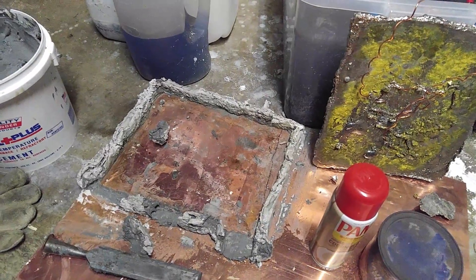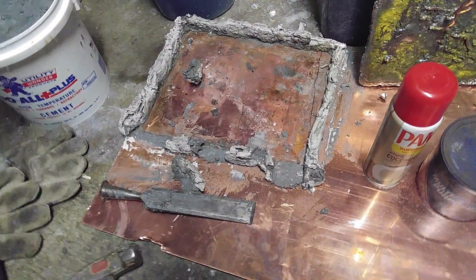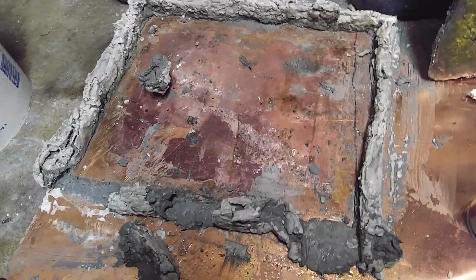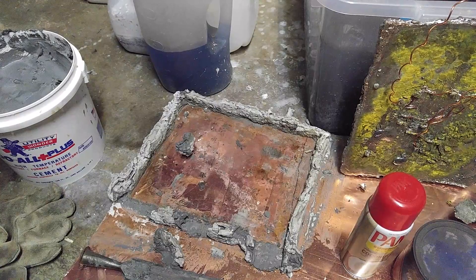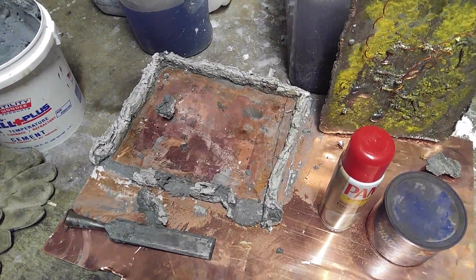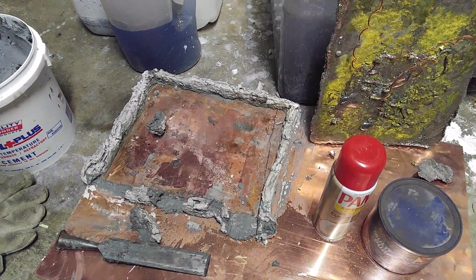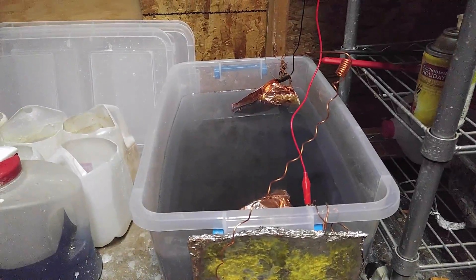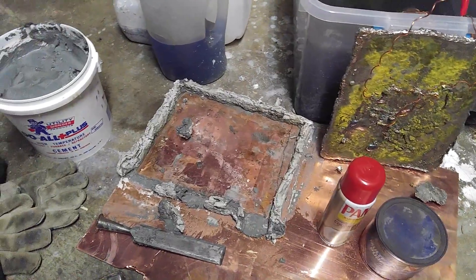After getting the electrodes in, I'll usually hit it with some distilled water in a spray bottle to help it cool. Then I use a hammer and chisel to chisel it up — as you can see, the wall is knocked down on one side. I get the chisel in a little bit on the first side, and I try to do it while it's still warm. I've found that peeling it up when completely cool is a bad idea — it tends to crack and chip easier. When it's hot but solid, it is much more forgiving. I'll be putting it in a 10-gallon tub like the one it's leaning on, and I will be making bismuth GANS. We'll see what we get — thanks.